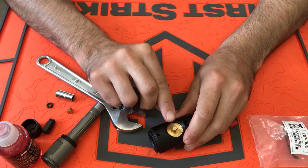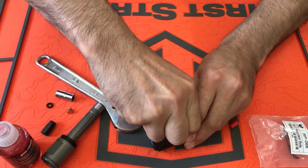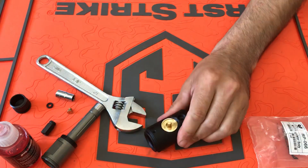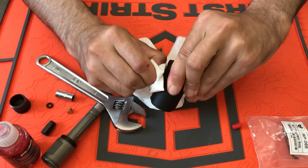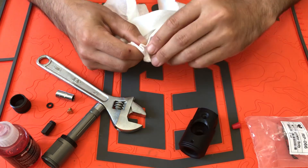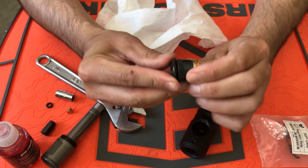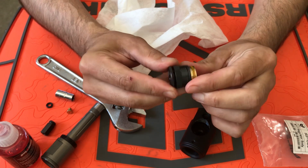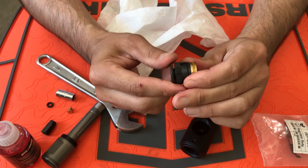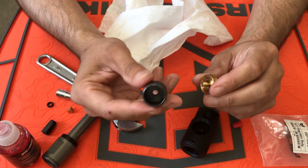The reason that I don't use the spacer or any of the washers anymore is — when your cap is threaded all the way in, this piston actually hits the bottom of the cap, hits the outer barrel, and can't go any further. So it's not even necessary to have anything up inside this velocity cap.